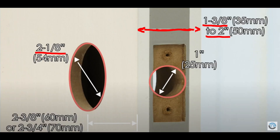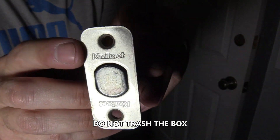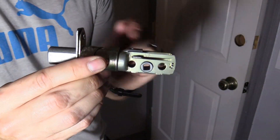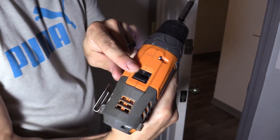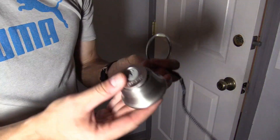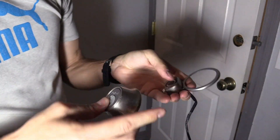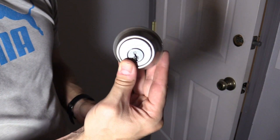These are the measurements you need on your door before purchasing. Now we're going to install the Access Touch. This is the existing deadbolt we'll be using — make sure it says 'up' when you install it and extend the lock out. Use a low speed drill and set it to a low torque under five. My deadbolt is circular, so we're going to use a circular frame provided by Lockly.